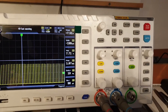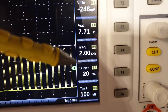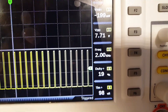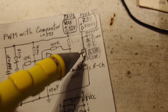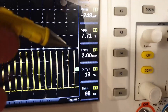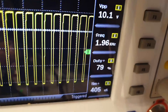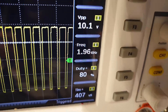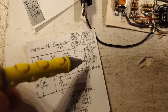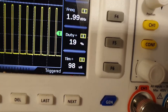Unfortunately duty cycle is showing 19-20%, not 10-11% as I got in my first test. I have a frequency of 2 kilohertz and duty cycle of 20%. I'm measuring between drain and source. Now I'll move the probe from the drain to the gate to see if the 2 kHz is mirrored. And there it is — on the gate the duty cycle is 80% and frequency is 1.96 kilohertz, perfectly inverted. This is what a pulsed MOSFET should look like — the MOSFET is acting like a NOT gate.